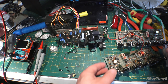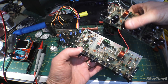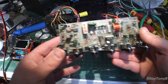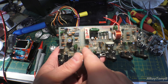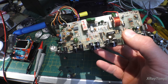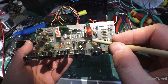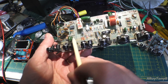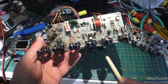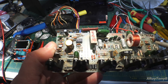Now the big one was this left channel board. The left and right channel boards are laid out differently — they're not the same. The left channel had a massive catastrophic failure. Those resistors that burned up are right here; I put two new metal film. This transistor was the one blown apart. This diode was bad, and this diode was bad. All the rest of them are perfect — there's nothing wrong with them.